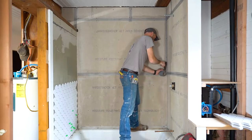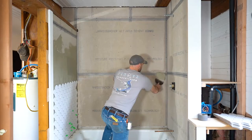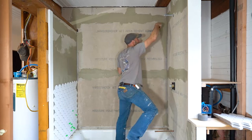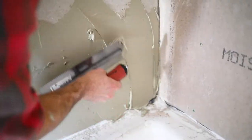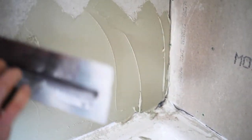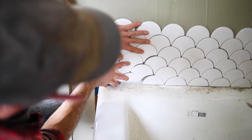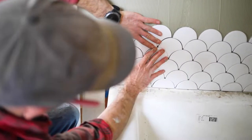One of the first things to do before you actually get tiling is to tape the seams on the HardieBacker. You take some thinset and an alkaline-resistant fiber tape and put those on the seams — that gives spaces where two boards come together a little extra support and makes the tile a bit smoother in those areas. I'm going to coat the HardieBacker with thinset using a quarter-inch notch trowel — just a nice even layer — that helps your tile sit flat. Apply the same amount of thinset everywhere, then place the tiles on there and firmly press them into place, which suctions them to the wall and allows fine adjustments for level.